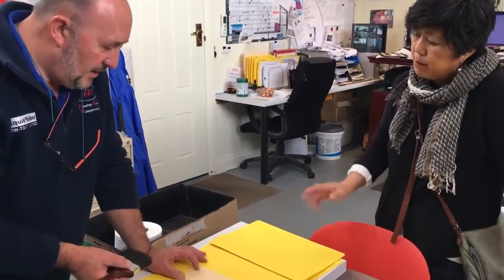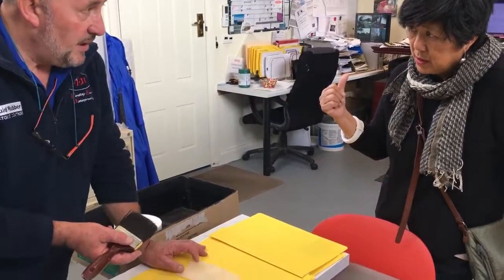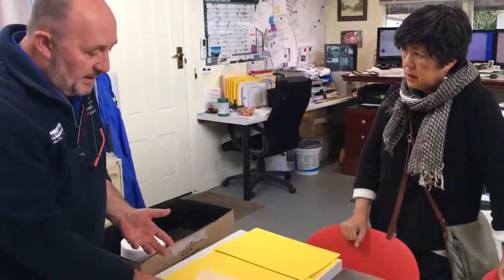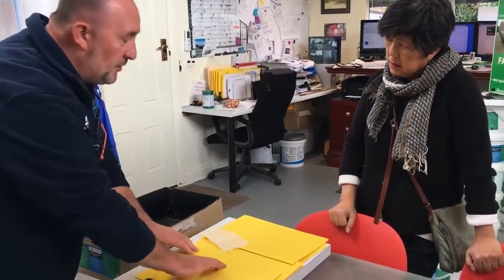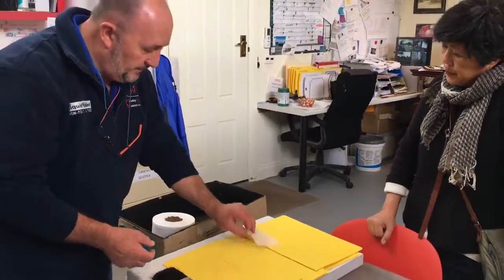And presumably I have to wait till the roof is completely dry. It's much better to have it dry. Even if it's rained and then it stops raining, you can wipe it down with a towel and dry it off. That's fine. The only danger there is that if there's water gone into that joint, that's going to slow down the curing and the adhesion process. It'll still work, but just slow everything down because there's extra water in there.